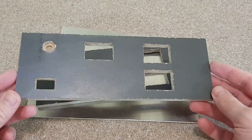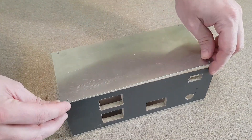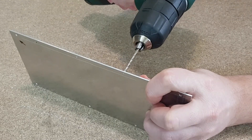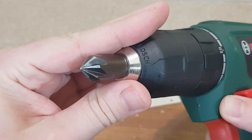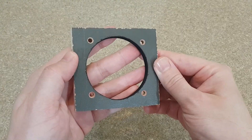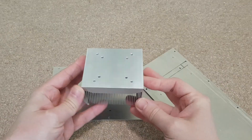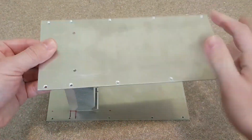After 2 hours of cutting and sanding, I have these panels, but they are not finished. The panels will be tightened together with small wood screws, so I need to measure and drill a lot of 2mm pilot holes. The holes in the aluminum panels need to be enlarged for the screws — I will use a countersink bit on the exterior side of the holes. In the back panel I made a big hole for ventilation and I will mount a 6cm protective fan grill. To attach the heat sink on the aluminum panels, I made 2 more threaded holes on each side of the heat sink.